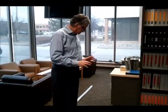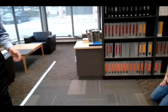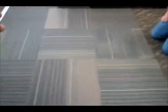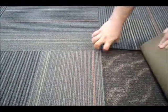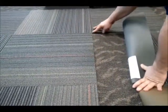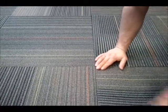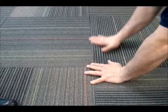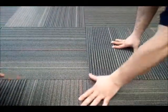What we have is a quarter-turn installation — that's what the manufacturer recommends — and we get an effect that we call the pinwheel effect. It creates the illusion that the tiles are staggered, but when we lift these, they are in fact on a dead-on straight line. As you can see, they butt perfectly at 90 degrees, but the illusion created by the linear look of the tile creates a staggered effect. It looks like the tiles are jumping over and staggering back and forth, when in fact they're not.